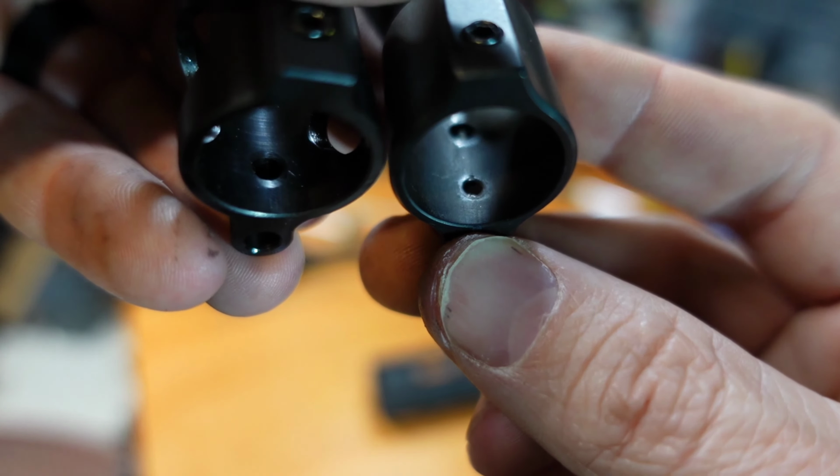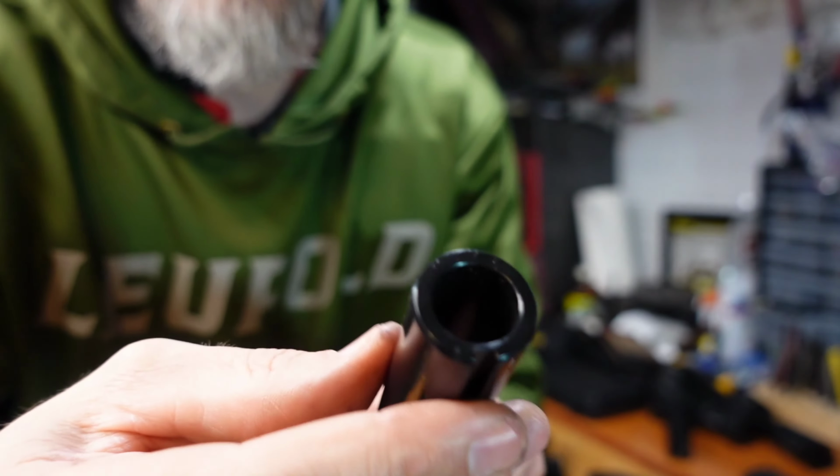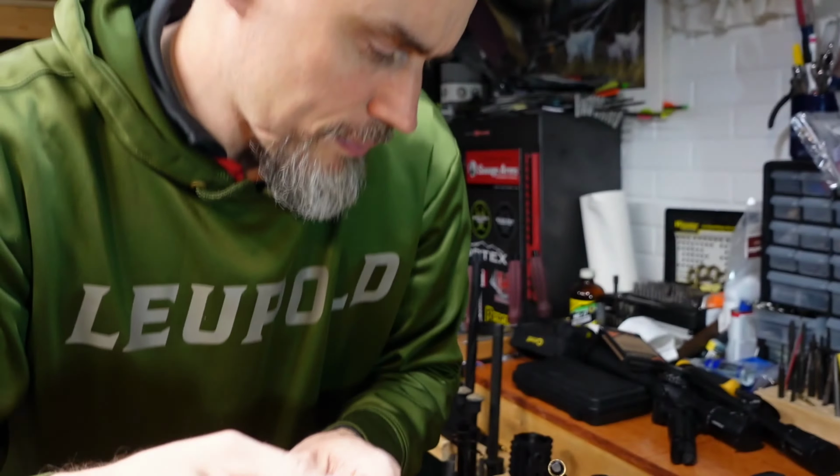What that is right here on the back of the bolt. We'll see if we can get it here in the light. You can see that shiny spot, and that is puckered out just a little bit. If we can, yeah, right there in the light, you can see that little shiny spot in there. That's sticking out. Now, most people probably wouldn't bother, but I don't like the idea of that hammering on that weight in there and possibly causing metal fragments going into my action. So all you need to do is take a stone and just shave that off. Yeah, you're going to take a little bit of the finish off, but realistically, who cares? I mean, you're going to have the thing covered in oil and everything. If you want, you can put a little bit of quick blue on there or something to cover up the bare steel. But I'd rather finish that up and just not have that be denting on my weight like that.